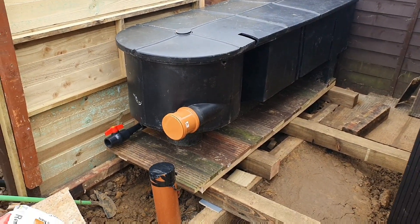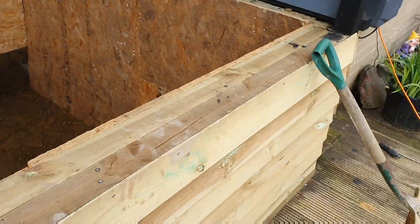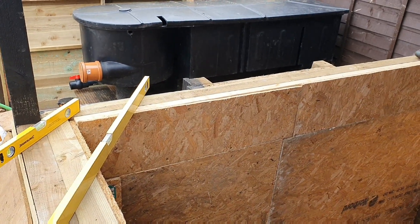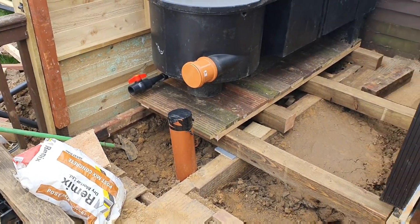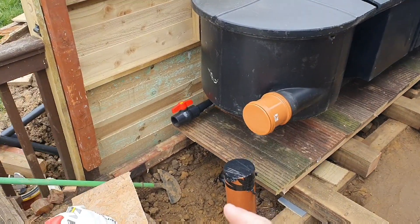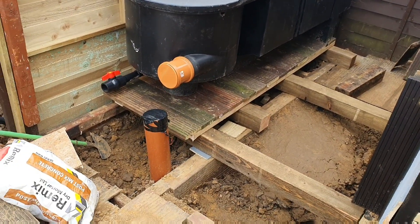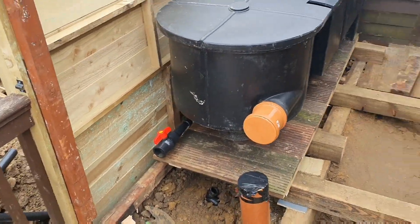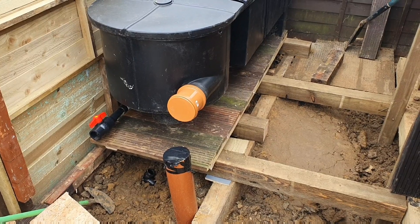I've ordered a four-inch ball valve and a T-piece. I was looking at putting in a purge valve - excuse the wind - but these ball valves are mega money at four inches, so you can know what you can do with that idea. Buying one of them is bad enough. So I'm going to put a T-piece in, like Martin down at Devon Koi Pond had advised. Put a T-piece in here and then have a piece of pipe coming up higher than the pond level - I've got a rodding point - so that's going to work out a lot less expensive than the second ball valve on a purge system. So I've ordered my ball valve and my T-piece, and I'll wait for that to come before I can do much more there.